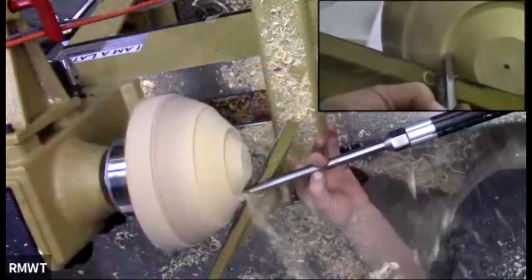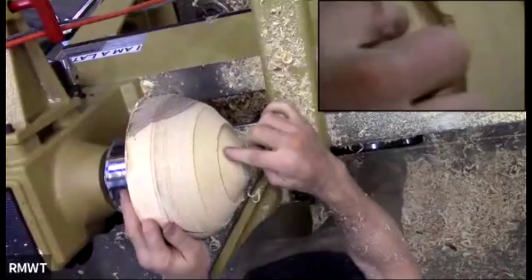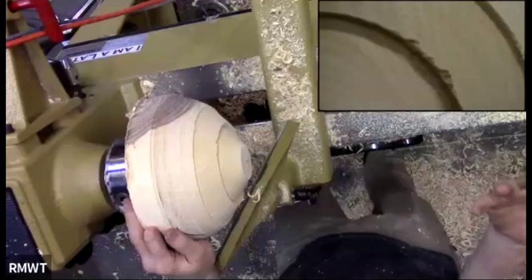you'll see it does tremendous damage to the side grain. See the side grain? It's mulching it, but not the end grain. See, it's cutting the end grain before it reaches the side grain peel. That's the secret to it. So you can use other gouges. Surely something else can do it.